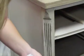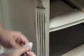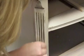And anytime you're working in a groove, y'all, use your finger, stick it in the paper towel, on the sandpaper, whatever you need to do. I want that to be more subtle. I don't want it to be just super obvious. So just take it and go in there a little bit. Sometimes I'll even almost wipe it off and just leave it even, just kind of like this one is, fade it out. So are you beginning to see the difference?